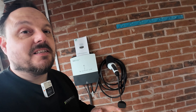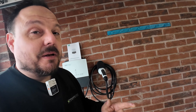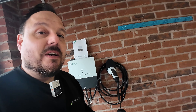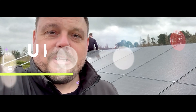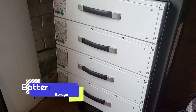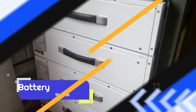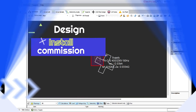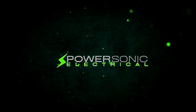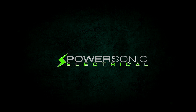What we didn't want to do was just fit an outdoor consumer unit — that would have been easy to stick one of the old outdoor jobbies under there — but as I've said before that isn't the right thing to do and it won't comply with the regs in my opinion, most of all because of the PEN fault risk with a metal board outside. Let's go inside and have a look in the cupboard. With these units they have the metal front cover that goes on with thumb wheels and screws so you can cover all the terminals.